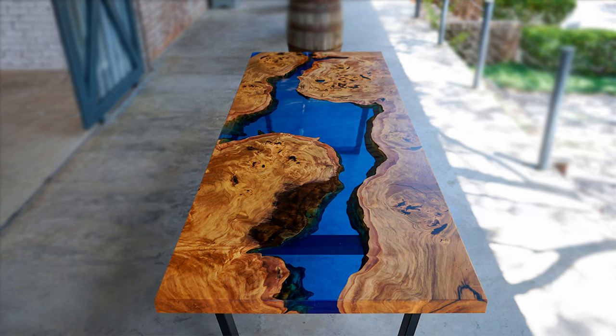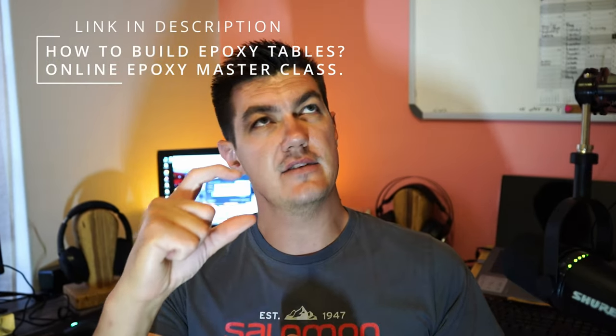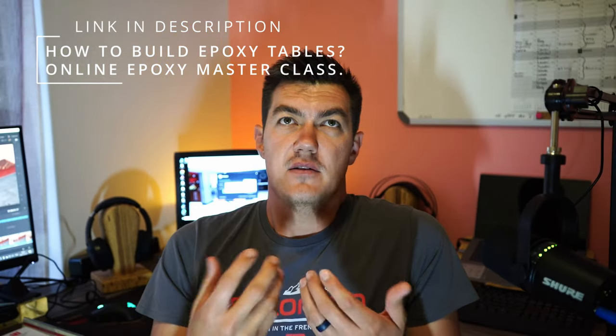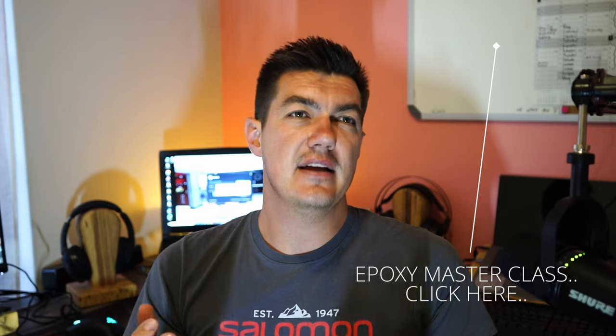What we would typically do is we are using a deep casting epoxy where we can pour up to about 100 mil. But because the typical tables we build are transparent tables and not a solid color epoxy, what we figured and noticed is that we would typically pour about 20 mil to 25 mil at a time. It basically gives us more working time with the epoxy and it releases the air bubbles much quicker.